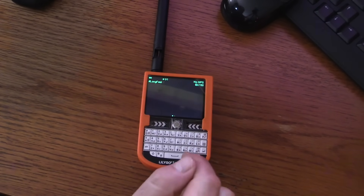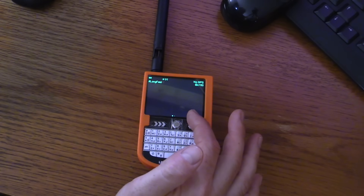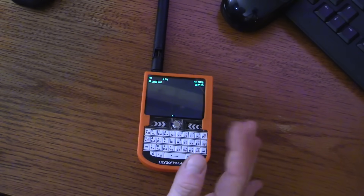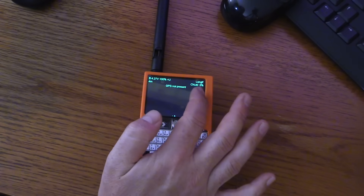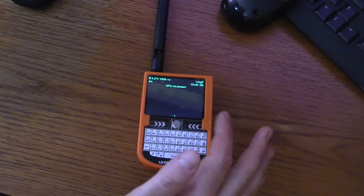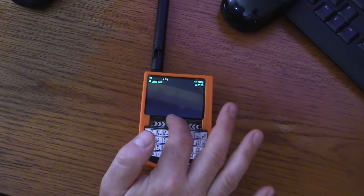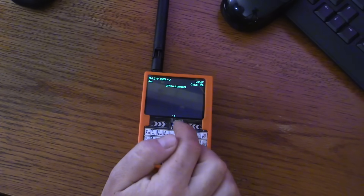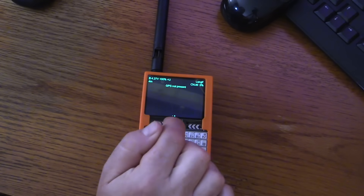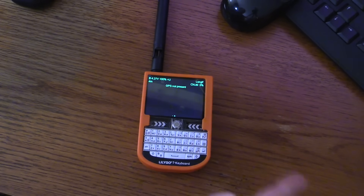I'm not really sure what I think of the LilyGo T-Deck here. I wish it did something else. It's great that it'll run Meshtastic, but it's got like a 400 MHz processor in there — you'd think it could have some apps or programs or something else running so when you're not meshing with people you could use it for other purposes. I'm also not really sure what any of this means — this channel utility, and it also says 'plus U,' which I think maybe means it thinks it's plugged into USB. None of this stuff makes any sense to me. I haven't actually found documentation for the interface. The deck itself also seems a little flaky — right now it's not connecting over Bluetooth, it's refusing to connect to my phone. I've rebooted this thing, restarted the app on the phone, and then last night I had the keyboard light up and it would never turn off — it just stayed lit up all night.